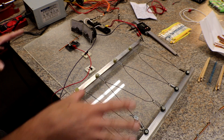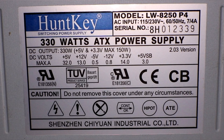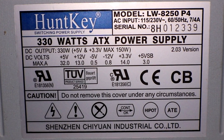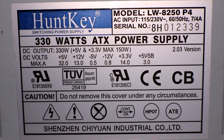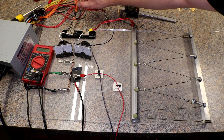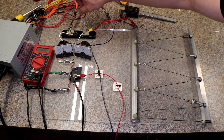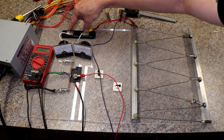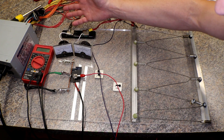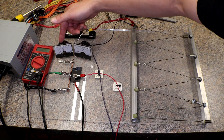For those of you that have never seen this before or don't know exactly what's going on, I'll explain it. I am using a computer power supply — nothing fancy — it's got a total of 330 watts. I will typically do all the tests on the five-volt or the three-point-three-volt rail. This one can do a max of 32 amps on the five-volt side and a total of 14 amps on the three-point-three-volt side. The orange wire I'll be using today will supply 3.3 volts. Red is 5 volts, yellow is 12 volts, and black is obviously ground.